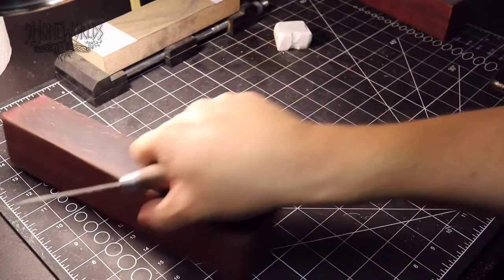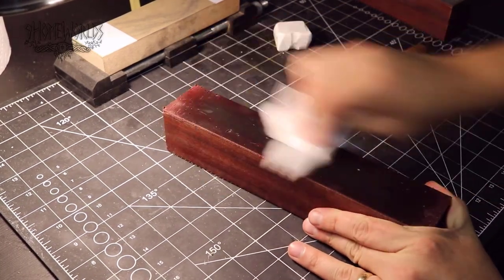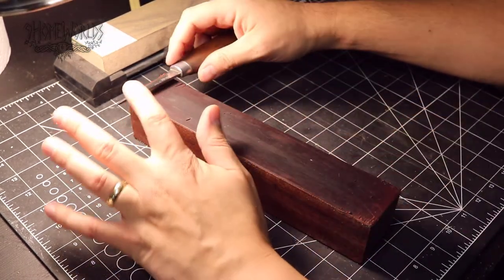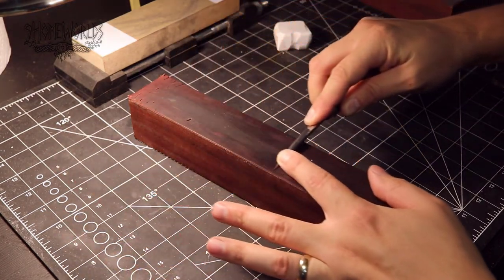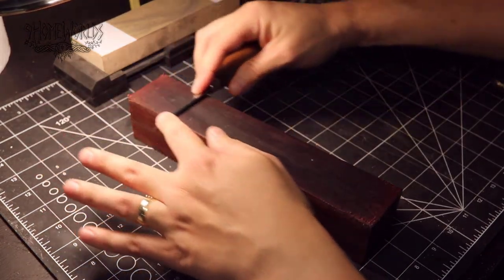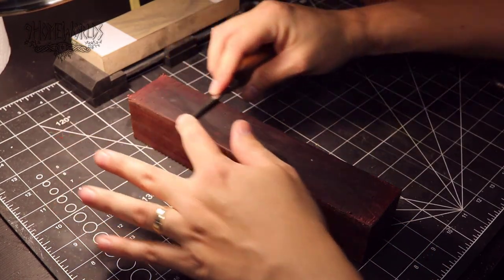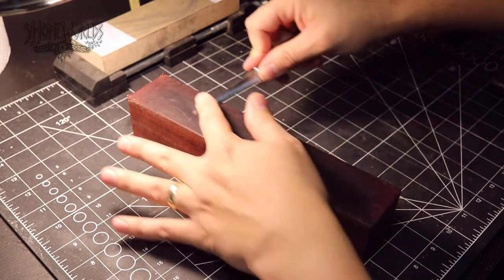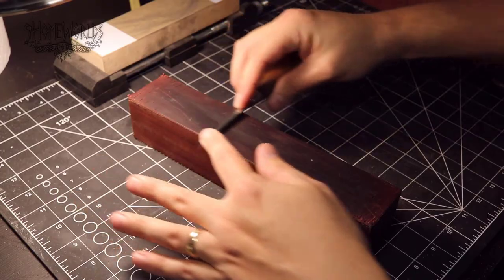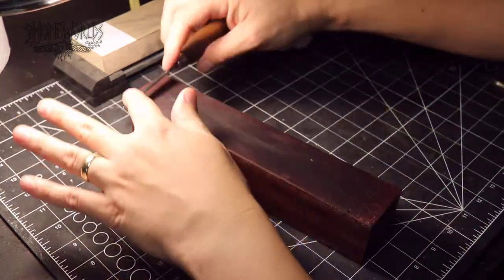I'll use a baby wipe in between to give the knife a good cleaning so it doesn't dirty up my already dirty strop, which I'm also going to give a quick buff and clean — much overdue. The final step is the smooth leather strop, back and forth the exact same way as with the wet-dry and honing compound. I'm going to do about 20 passes — about 26 in total — to give it a very final edge. This removes any small amounts of wire edge or burr to make sure the edge is super fine.